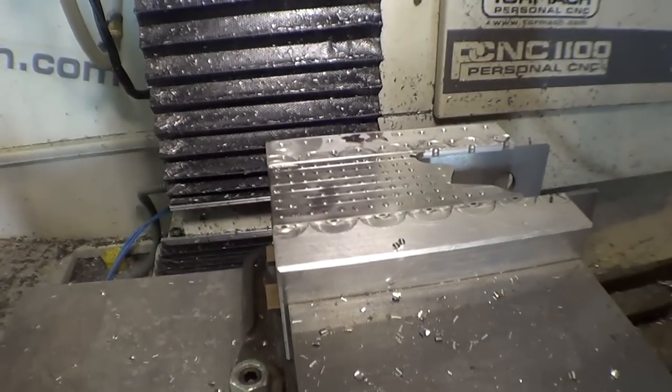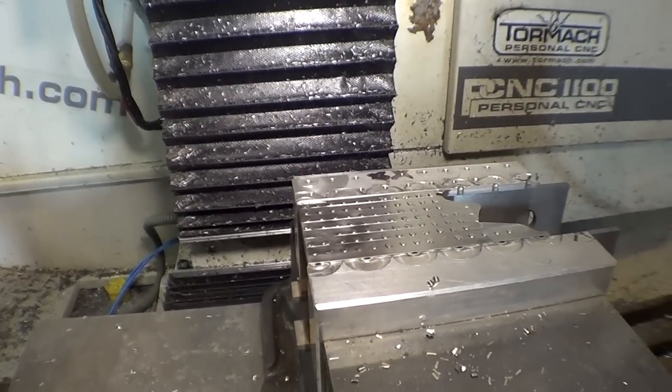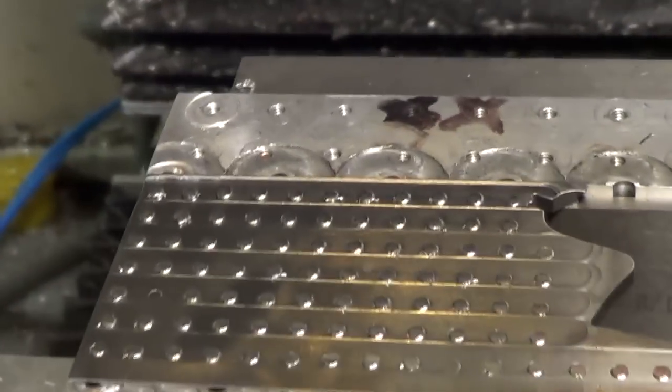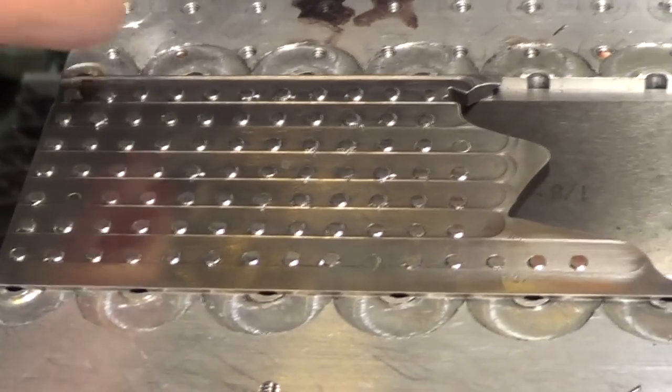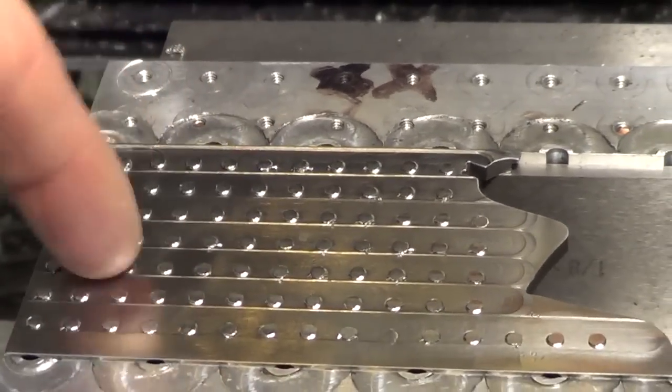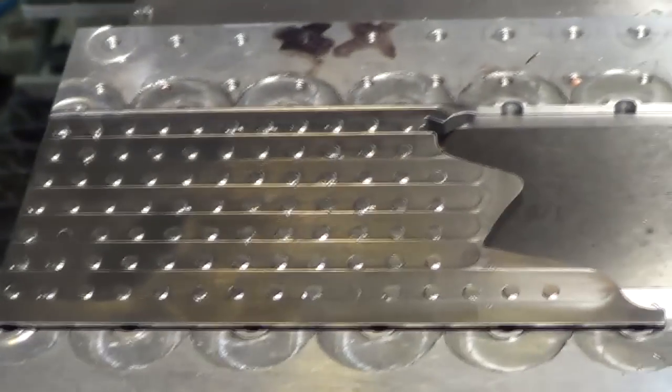You can see all the little bits of screw right there. When I buy the screws, they are 1/4 inch long. I need them to be 1/8 inch long. So when I first started making these Norseman knives, I took an extra piece of RWL blade steel and I just drilled and tapped a bunch of holes. I used a thread form tap.